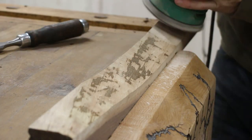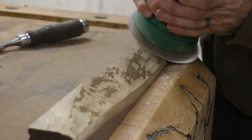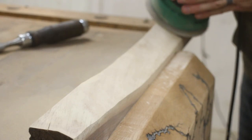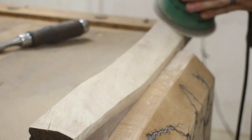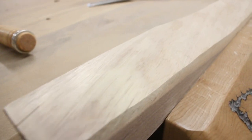I've since learned that once you get to the cambium layer it's a good idea to stop and use a wire wheel instead of going straight to sandpaper the way I did here. I sanded this nice and flush and honestly I think it looks beautiful just the way it is, but if you want to leave more of a natural texture on the wood it's a good idea to hit it with a wire wheel — all of that comes down to personal preference.